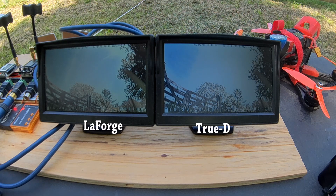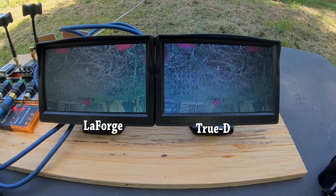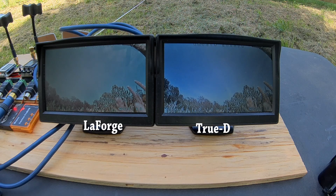Here I am setting up the experiment. You can see I put both transmitters on 25 milliwatts. Here I'm setting up the 5740, and I set the 5760 the exact same way — 25 milliwatts. You can see that both of them are using TBS Triumph antennas, and you can just barely see the X-Air 10 dBi antenna as well. I assumed we were using the 10 dBi antenna for most of the tests. Smart Audio is a lifesaver here — very easy to change the transmit power and the channel.